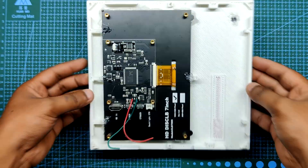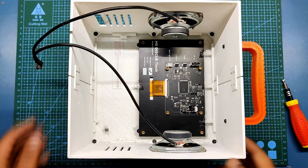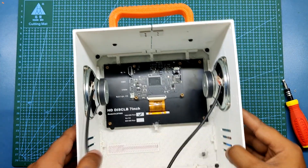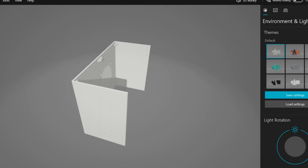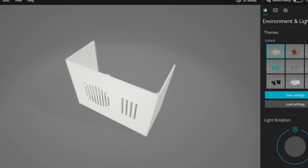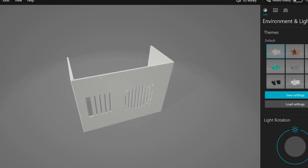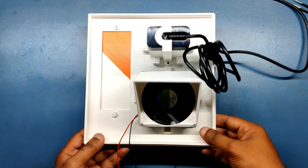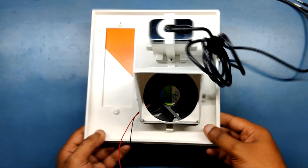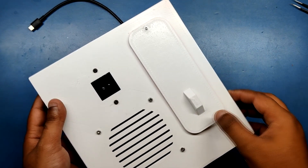The base body holds the display, logo, and the false floppy disk add-on. The middle body holds the speaker, LattePanda, and 3 internal supporting pillars. The middle body is divided into two parts to reduce print time from 19 hours to 10 hours by using a 1mm nozzle. The back lid contains a DC fan with a funnel for airflow and the LattePanda adapter holder. It also contains the lid of lid, which is a part added to the back lid.